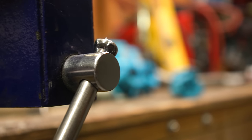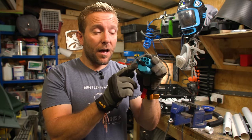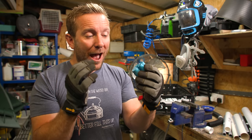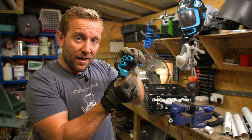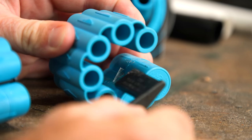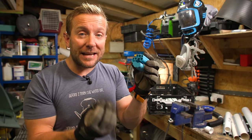So let's meet the PolyZip Flex C1. What an absolutely lovely beast it is. It cuts 15 to 28 millimetre. It has on the back of it a very small protector for the blade that you can take out and pop in reverse. The technology behind it that I absolutely love - that means this can do 15 to 28 mil all in one - is that it can spread. It spreads like that, and it automatically closes to the right size of pipe that you're trying to cut and then cuts it. Inside, we've got a slanted, very sharp blade that is kept away from your hands at all times. We've also got direction arrows on there so we know which way to turn it. It's a foolproof, easy tool to use.